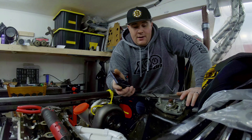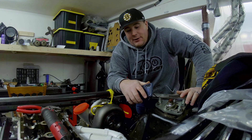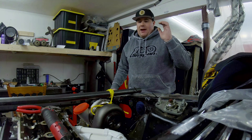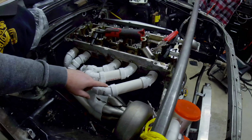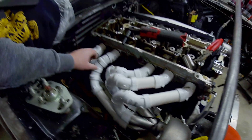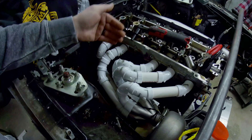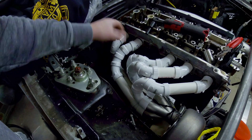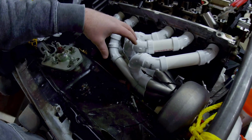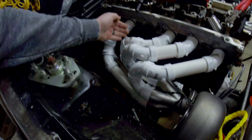Camera died, but in the past two days I've moved the turbo about five times and done about six different variations of routing. So skipping way ahead - I went ahead and got five of the runners done. If you look here, we got runner one, two, three, five, and six. This one's just sagging a little bit. This isn't going to be a perfect representation of the runner when I'm welding it, but it'll help me get an idea of where and how I want the runners to go. The biggest problem right now is this first runner area because if you move it, this runner gets into the way of runner number three.